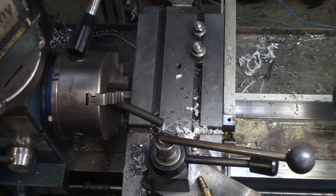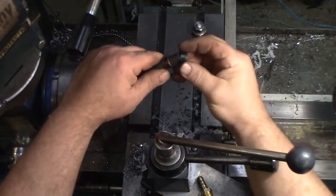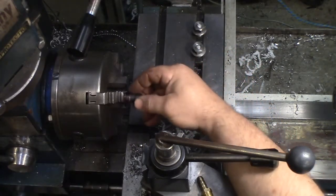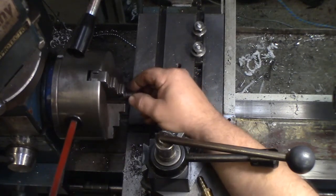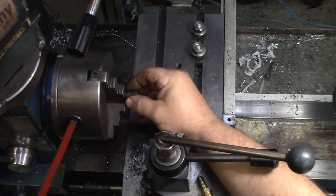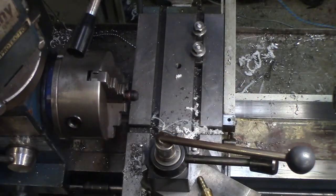I believe with all the extra clamping pressure we're getting off of those ferrules, as long as there's just enough there for the rubber to bite into, it's going to hold just fine. I have not bothered with chamfering the ferrules at all. I want to see how that holds up and if it presents too sharp of an edge and makes the hose wear out quicker at that back section where it would flex against the back of the barb over use. So this is another test. Heck, if you're going to do it, might as well find all this stuff out now.